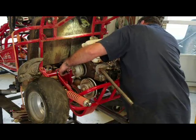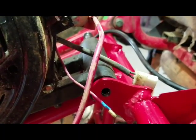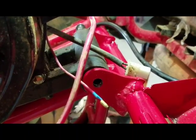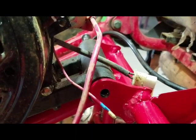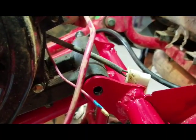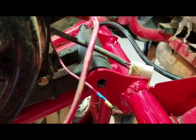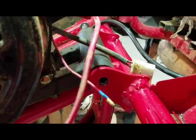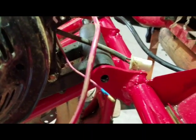Going to get lucky on this, because the problem I'm having, I just realized. Inside that pivot, there's not a sleeve that goes all the way through. There is a bearing at either end. So when I push the bolt through the left tab and through the left bearing, inside that tube on the pivot, it opens up. So the end of the bolt, I've just got to get lucky and try to get it through the bearing. Once I get it through the bearing, I should be able to move the engine around a little bit and get it to slip through the tab.